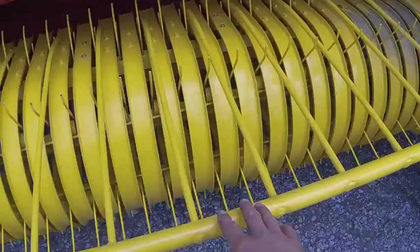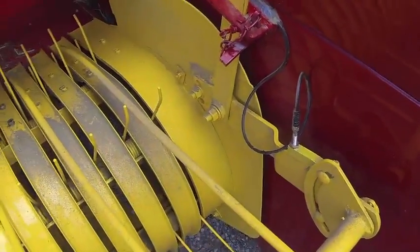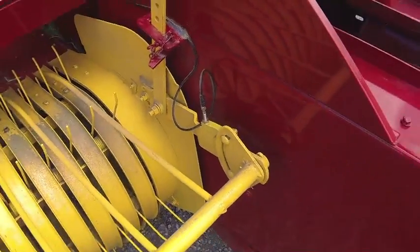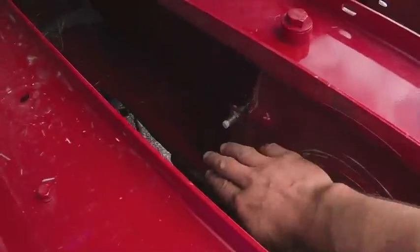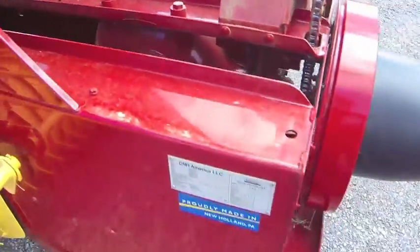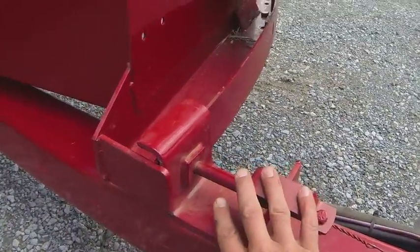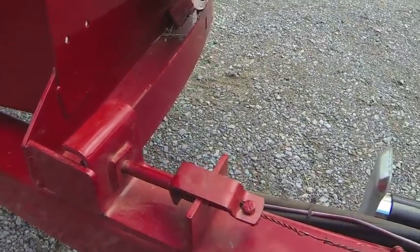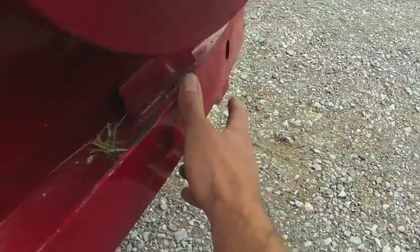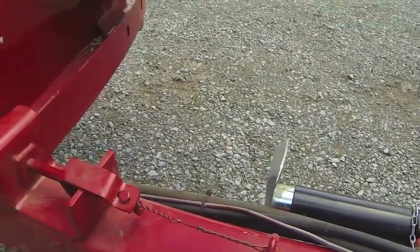This is the pickup of the baler. We also have a sensor here so we know when hay is going in — that turns our preservative on and off, along with our moisture sensor. We also have a sensor on the plunger to determine when it's all the way back. We safety-wired the pin out so no string has to be pulled — it's purely hydraulic. You want to run it all the way over to the stop, which is here, and you should be in good position for field mode.